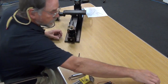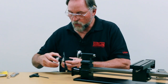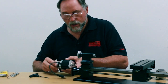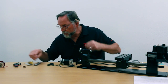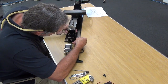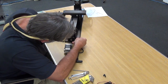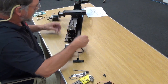On your stepper motor, find the set screw that's holding your adjustable hand wheel on. The flat on either end is the same, so you can see where your set screw is in the hand wheel and adjust the flat on the inside to match. First, turn the ball screw until the set screw is aligned with the access hole — that's aligned right there.